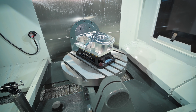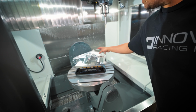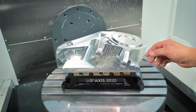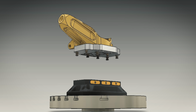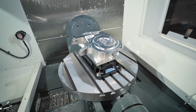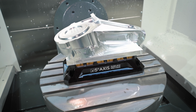And on the second op, after we machine and tap all the snout bolts, we'll make a plate that bolts to that, and then it'll have a similar pattern, like the 8 holes on there. We'll probably just do 4, and then we'll flip it over and bolt it down that way and clear out the second side. So on this first op right here, it pretty much does about 75% of the spindle. This one isn't done yet, but we gotta do a couple.